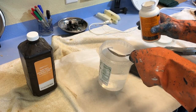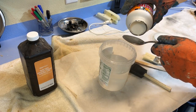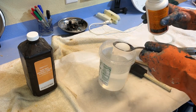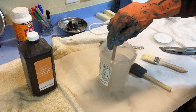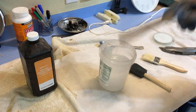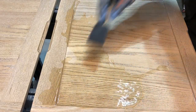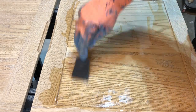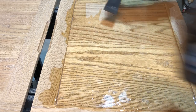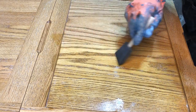Here I am mixing one and a half tablespoons of lye into two cups of water. Now I'm applying the hydrogen peroxide — this is your regular 3% that you buy at the pharmacy. I apply that to the wood and then I apply the water lye solution and let it dry. Look at the yellow coming up already.